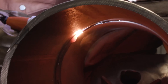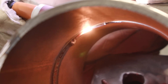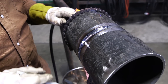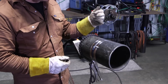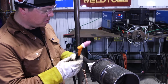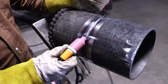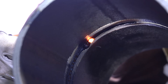Now I'm just going to continue to move on forward, go all the way to our tack and tie in. We got an excessive root in there. I'm going to mark up the area and thin it out. I'm going to have a 3/32 with me just in case it tries to tear open because it's too thin. Basically I'm going to use the TIG torch, heat it up really hot, and then actually walk backwards. What that's going to do is suck that metal up from the inside and kind of pull it up to the surface.